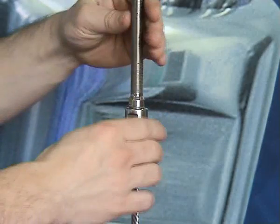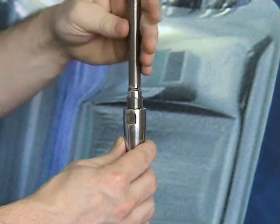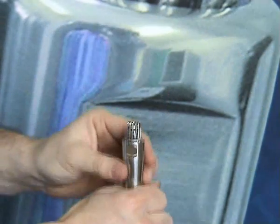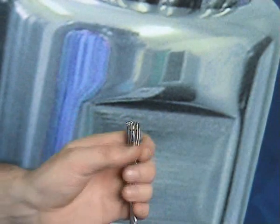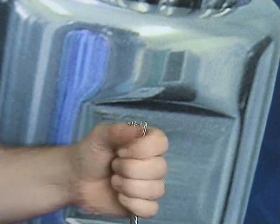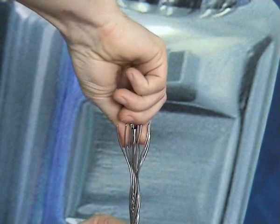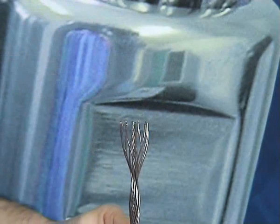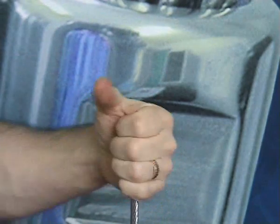The Hi-MOD compression terminal, unlike any other compression terminal, can be dismantled for inspection or cleaning. This is particularly useful when being used with furler systems, or even when a wire is too long and has to be adjusted. All components can be taken apart very easily, making this end fitting very user-friendly and extremely versatile.